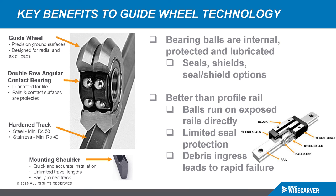Another key benefit is that the critical components — the ball bearings — are located internally inside the guide wheel, protected by seals or shields that keep debris out and grease in. These wheel bearings are lubricated for life and do not require maintenance, although it is recommended to provide a light oil lubrication on the wheel-to-track interface to lower friction. Compare this to recirculating ball linear guide technology, where ball bearings roll directly on the exposed linear rail — any debris must be removed by the wiper seals, and dirt ingress will lead to rapid failure, with no wiping action.